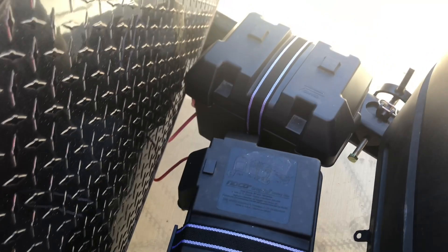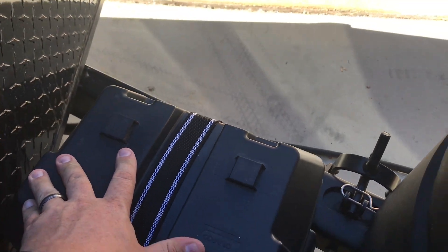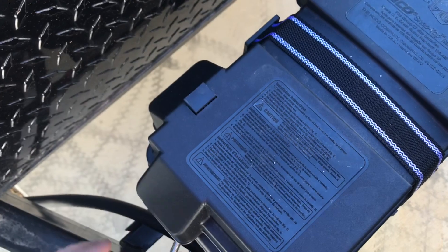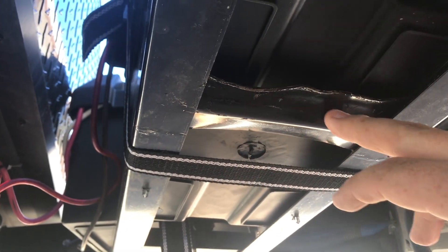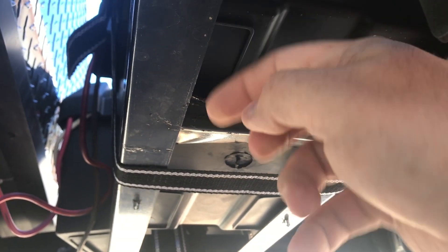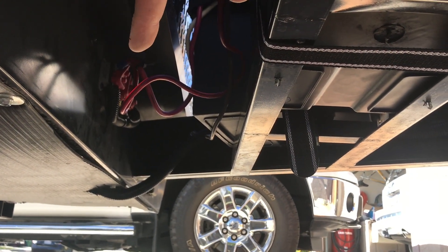To help out with this, I also added another battery. This is my original battery box that came with the unit. What I did was I turned it at almost a 90-degree angle, put a piece of wood underneath on the stand right here. And then this is a Group 27 battery box I added. The way the tray is designed, there's an L bracket in here — I basically grabbed my pliers and folded it down as best I could. I was then able to put the battery box on here and slide it over as much as I could. So basically I can have a Group 24 box over there at an angle and a Group 27 box sitting right here as well, and they're still anchored in place and tied into the same common bus.